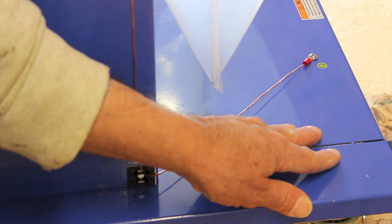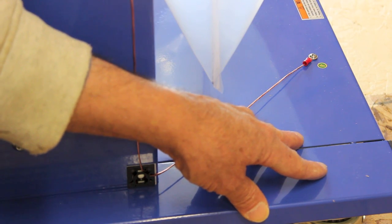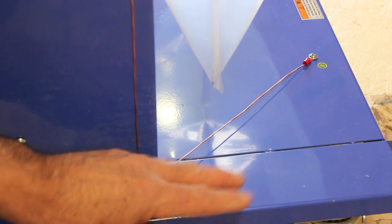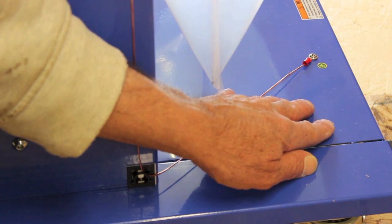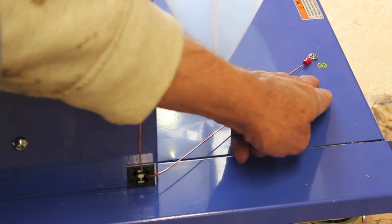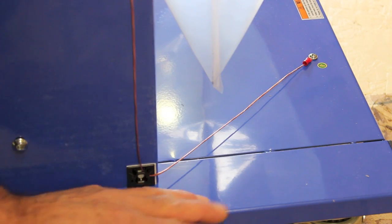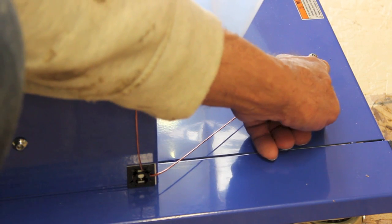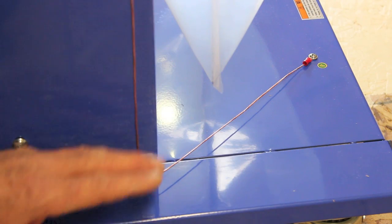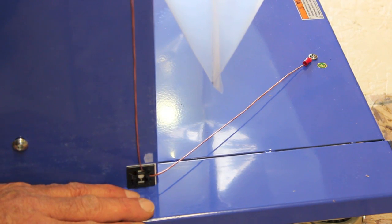When the system is properly wired up, the electrical ground will be the ground for the unit, so any static electric charge that builds up will, in theory, dissipate to the ground in the power line. The next thing we need to do is check continuity. Now that all the connections are made, we need to make sure we have a continuous, unbroken circuit between the ground screw and each of the drops and to the farthest reach of the dust collection piping network.